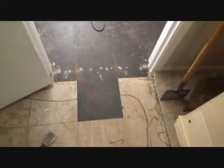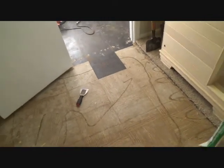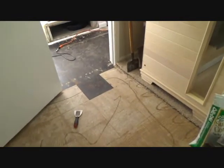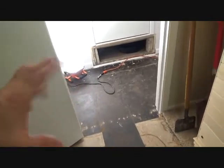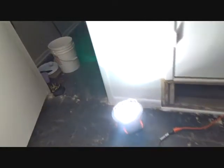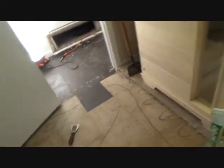Especially, I'm going to use a Hudson sprayer, and oh yeah, it works pretty good. So you stick around, watch my videos. I'll show you how to do that when I get these floors ready. But for a Hudson sprayer, you're kind of putting a variegated look on it, and it's very difficult to stop in one thing. Like, let's say we do the closet first, and then we stop it right there, and the next day we do the hallway and this bedroom, let's say, all in one go. Don't do it. It's very difficult to match, okay?